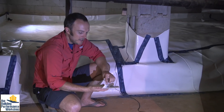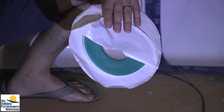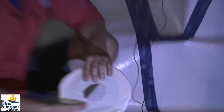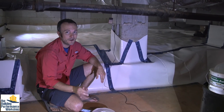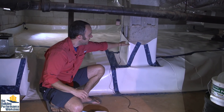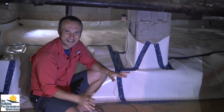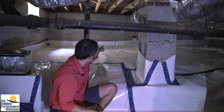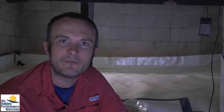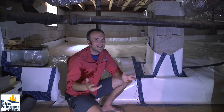I also love this multibond, which is a pre-formed gasket — it essentially takes the place of caulk or adhesive that you'd apply with a caulk gun, because caulk guns are not reliable in my experience, and I haven't met anybody who's that good at applying stuff with those guns. That multibond is what's applying this tarp to the cinder block walls and brick, so we're sure we've got an air seal. We had a couple places where we had to skip it, like around the water heater. We haven't done the rim joist, and we haven't sealed the cinder block wall itself — you can see weep holes going through it back there. That's going to be covered with the DA membrane. It's a cool experiment using high-performance new construction building materials for a retrofit.